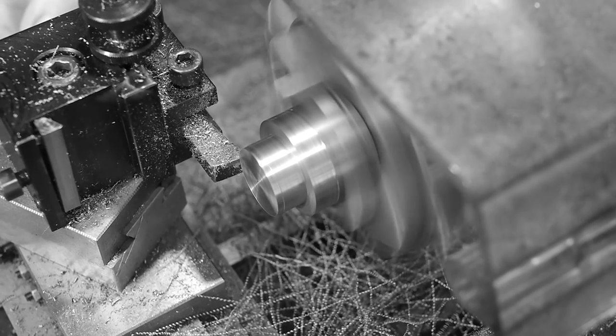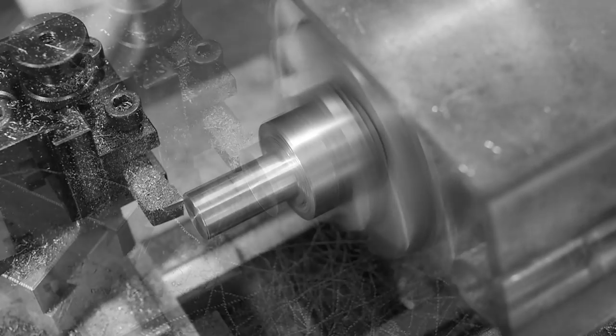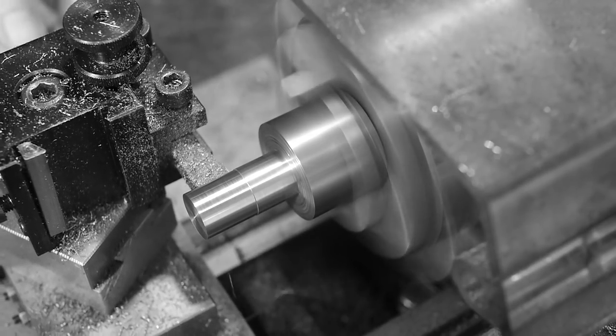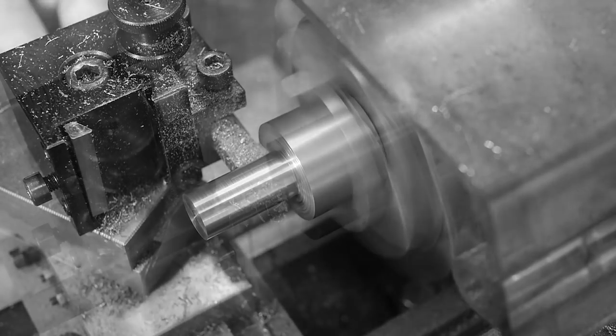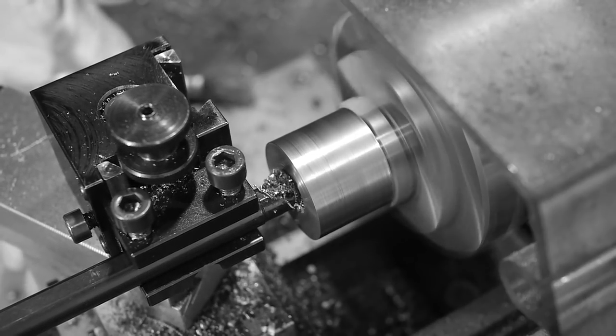I published a video a couple of weeks ago about making a slitting saw arbor to use in the Proxxon mill. There was some interesting discussion in the comments about the video, with some recommendations about how I could improve the tool. Mark Halmagiu pointed out that I could streamline the tool by making a counterbore for the head of the screw without compromising the strength and clamping force.